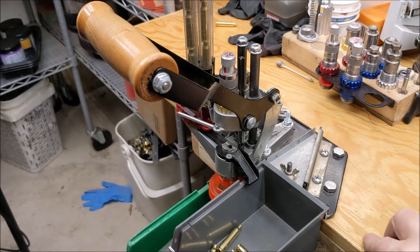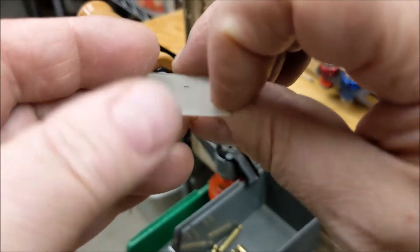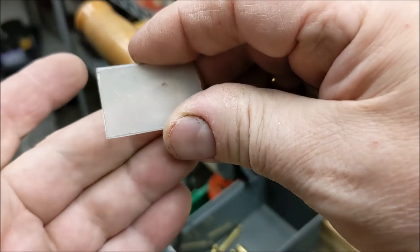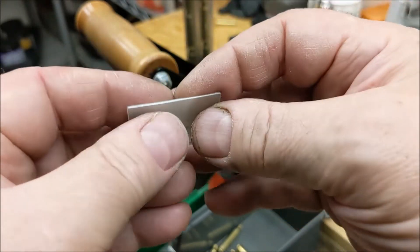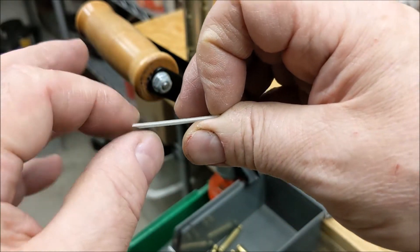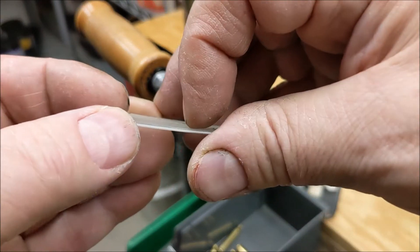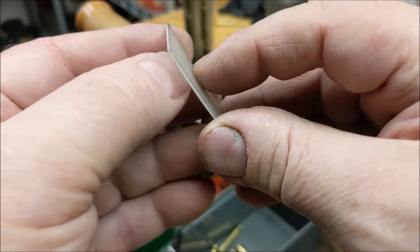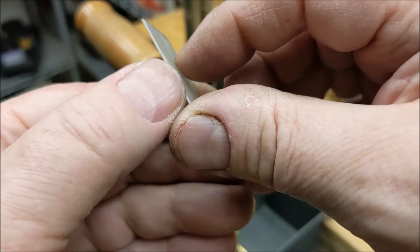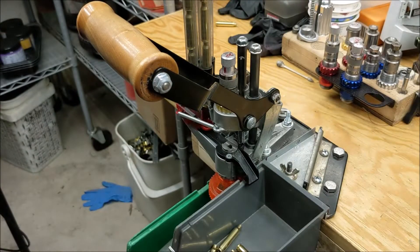Basically what I took — I took some of this. It's like a one-mil cheap plastic cutting board, and made a feed gate. Now one piece isn't thick enough; I had to triple it up near the bottom, and I kind of stepped it. I went from one layer, then down to two, and then down to three, for clearance issues.